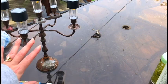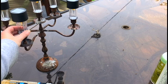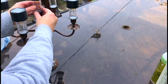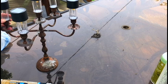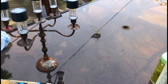Okay, so that's it. I'm just going to let it sit because it's still kind of wobbly, and usually silicone within about 30 minutes is set. So within that 30 minutes, if you want to level things or move things, as you look at it, you've got about 30 minutes. Then after 30 minutes, it's pretty much set, and it does take 24 hours to cure. So don't do anything crazy with it for about 24 hours.